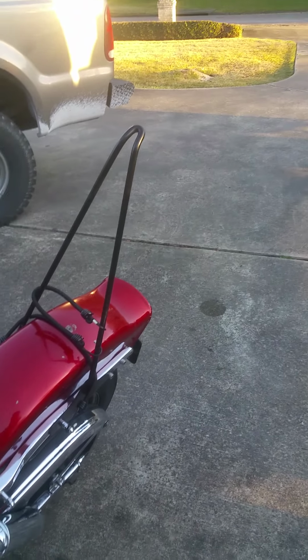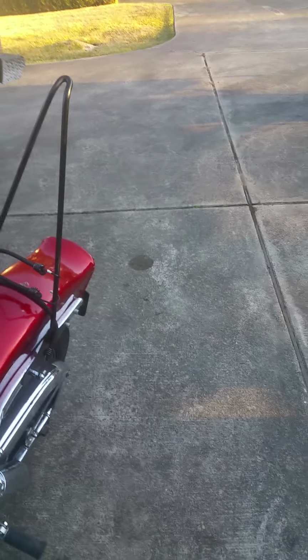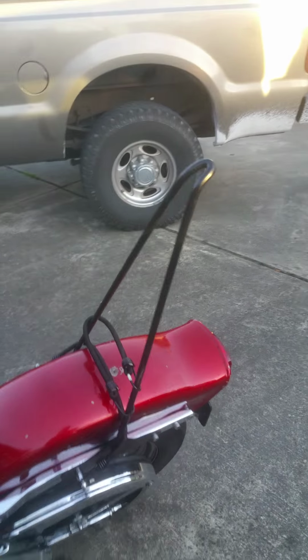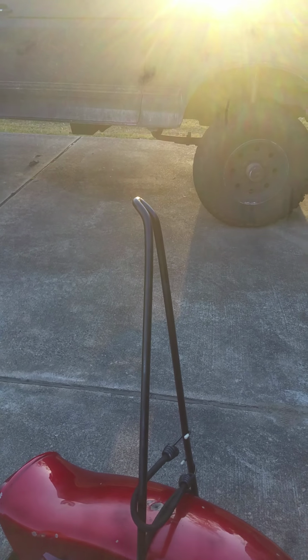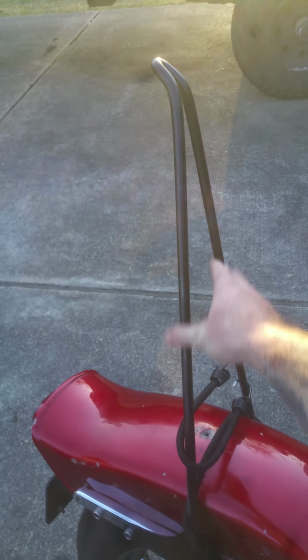It was pretty malleable, but that gave me a good center point, like a pivot point to bend it around and get a good even bend on it. And then while it was still hot, I pulled the hammer out, just left the vise cracked maybe about an inch, and stuck the end in and did my little bend back.